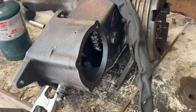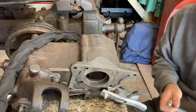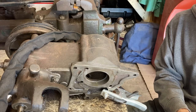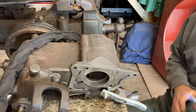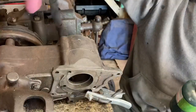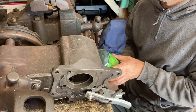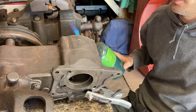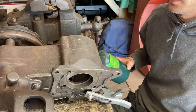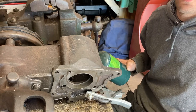I really have no idea how this is going to go, but it's pretty low risk given what it is. I don't have much experience with cast iron, but I do know you want to heat it up. So I'm going to heat up this area with just a propane torch from both sides, get it nice and hot, and then we'll try and melt some wire into that hole.